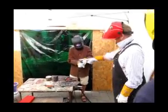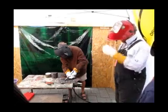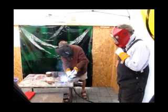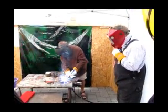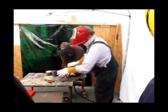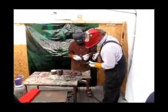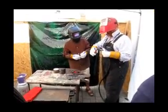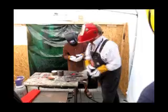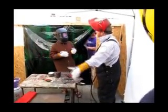That's the trigger. You can go forwards or backwards, it doesn't matter. Get a little bit closer in — you're a bit far away there — because what you're trying to do is get that cloud of gas surrounding the weld. If you're too far away the gas is blowing and it's not doing its job.